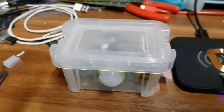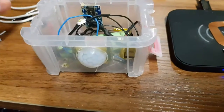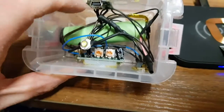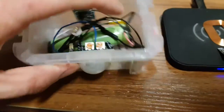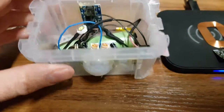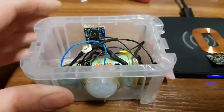So what I'm going to use it for - I've built this little box a little while ago. It's just a normal Tupperware box, and inside you've got a motion sensor, an 18650 LiPo cell, a battery charge controller for the LiPo cell, and a little MOSFET to turn on an LED. So this sits on the stairs and when you walk past in the middle of the night, it just turns the light on so you can see where you're going.